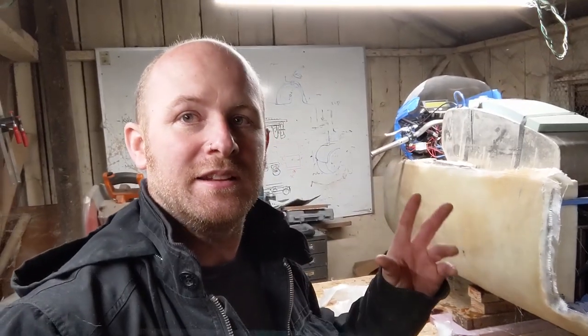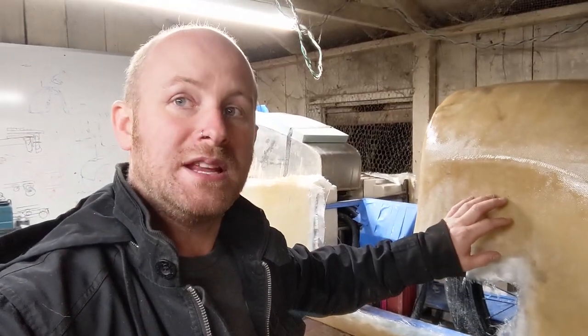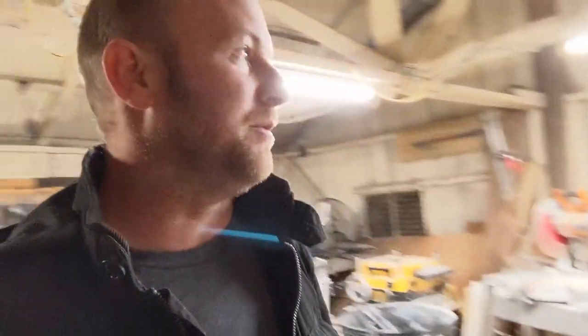Well, we had another day of layup, and we got three more layers. We actually used medium hardener today. It's because it was a little bit warmer, and it actually went a lot better. We had about 2 hours of time where we could put all the layers on. Probably cut the panels off at this point, and then build some mounts, prep for paint, sand it, everything else.